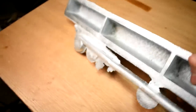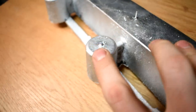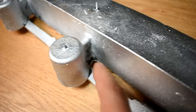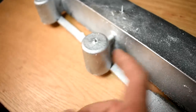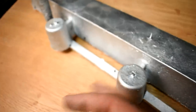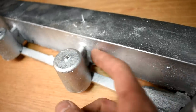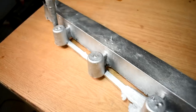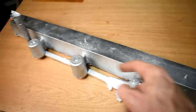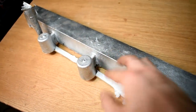But there is a problem. You can see the tops of the feeders aren't really sunken in. What happened was this ingate — this knife gate — froze first, or the part ended up feeding the feeders or something. This did not work out. So if I had to do these again they would be wider, much taller, and thicker. Or maybe just don't bother — probably don't need the spin trap for this either; I just did that out of habit because I printed it. Next time I'll start by cutting all this off, try to finish it up, and then start scraping, so we'll see in more detail if there's any damage inside.